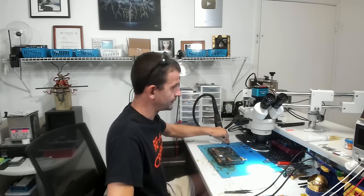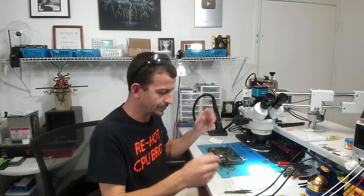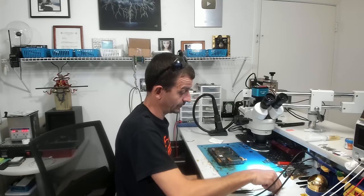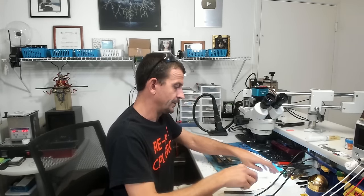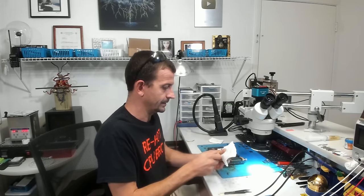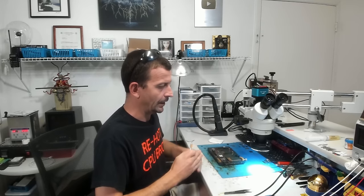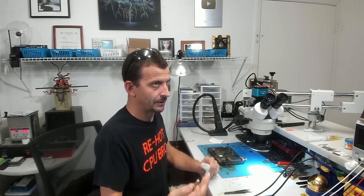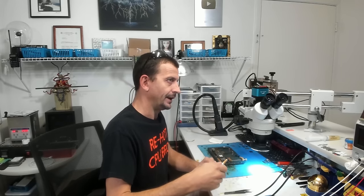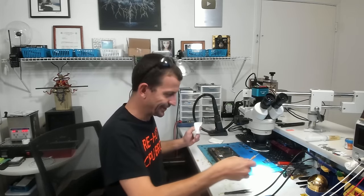The first thing I'm gonna do is hook power to the battery terminals and make sure we don't have any instant shorts or anything. That's the main thing, actually one of the main things. And then also this board, it was turning itself on. The moment you hook up power to the battery terminals, it would power on. It would boot, decide the battery was too dead, it would shut off. And with it off, it would charge, boot, decide the battery was too dead, and then shut off.